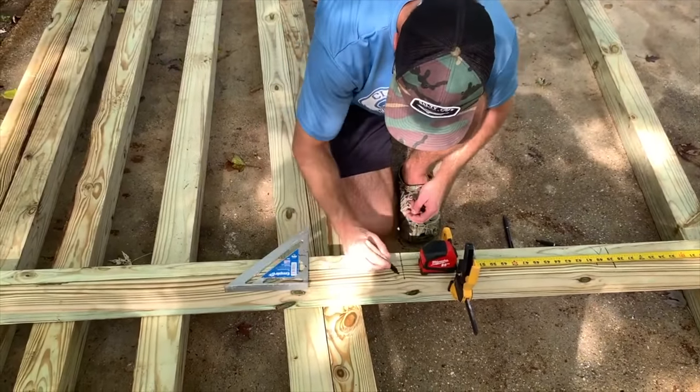You're then gonna fasten through the second panel and through the first panel through the overlap using a fastener that embeds a minimum of 1.5 inches into the stud. But because we have a window here, what I did is I just got it in place and I used a bar clamp to temporarily hold it where it needs to be. Then I went on the inside, I marked the window cutout with a Sharpie, and then I just pulled that panel off and made the cuts. For me, this is easier, but you could obviously measure this instead of putting it on and taking it off.